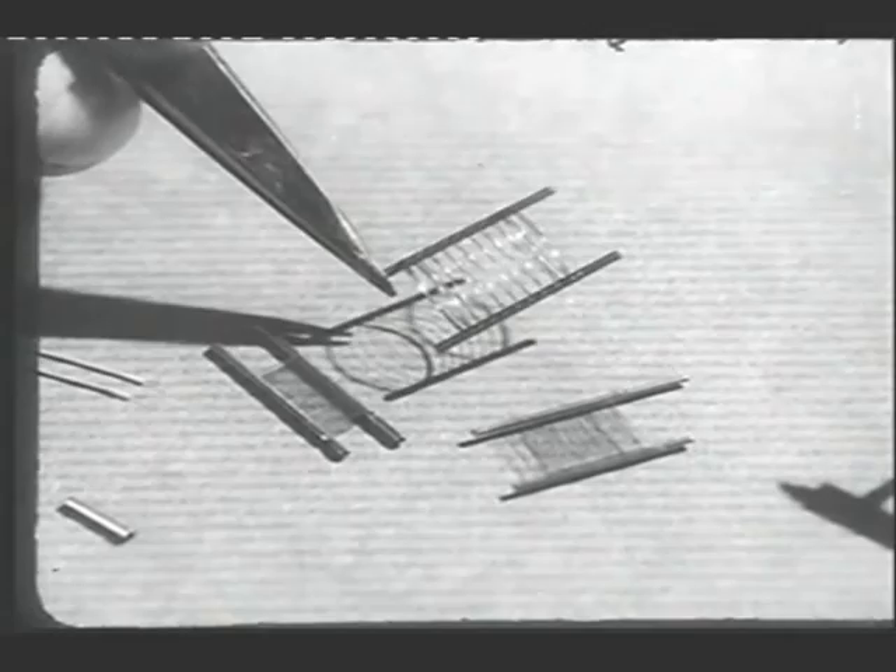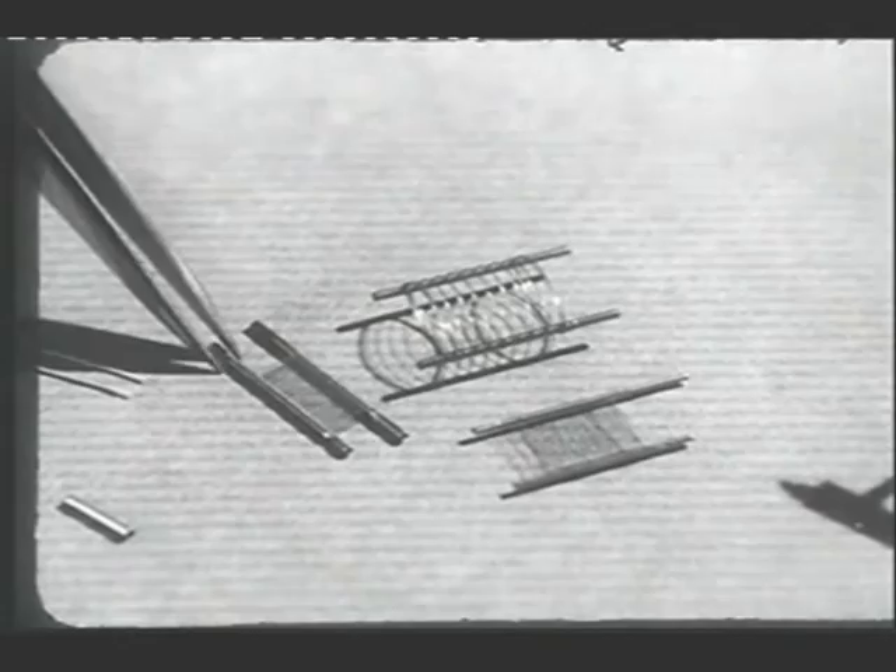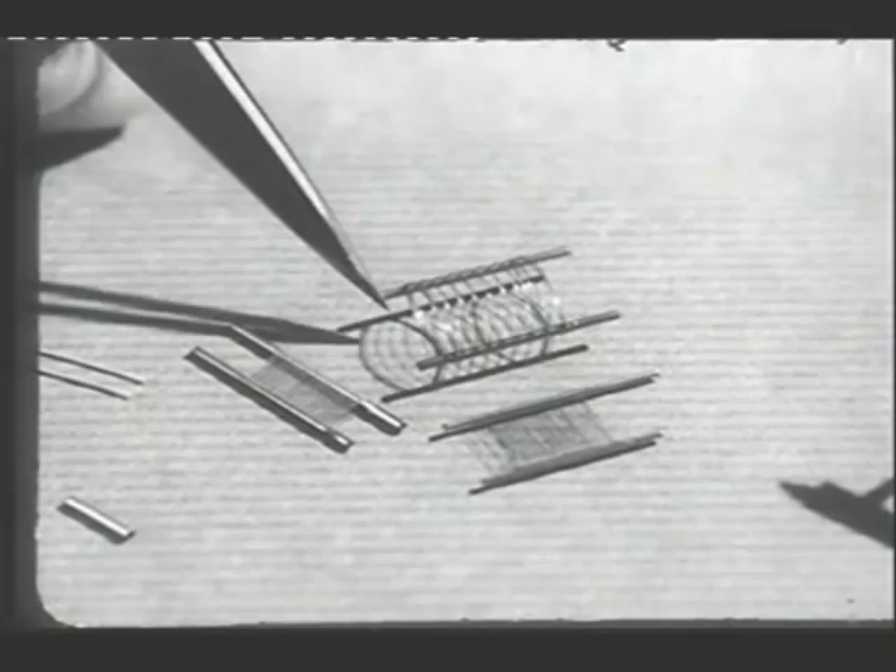These are typical grids, flattened spirals of fine molybdenum wire, wound on two stout backbone wires. In the pentode type of valve, there are three grids: the control grid, the screen grid, and the suppressor grid.